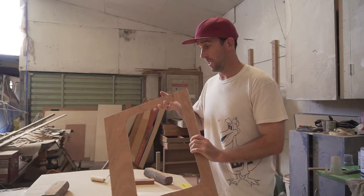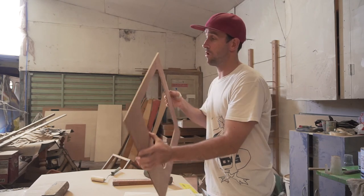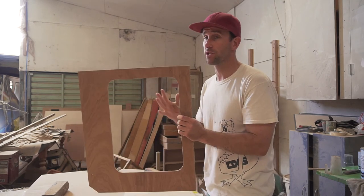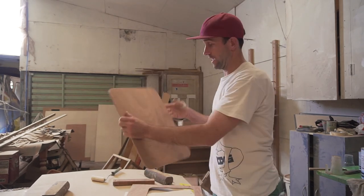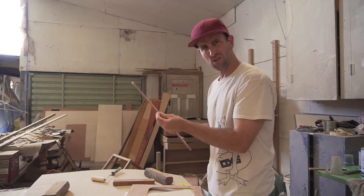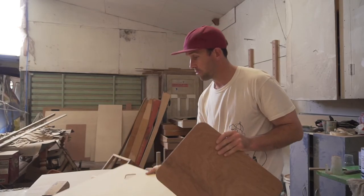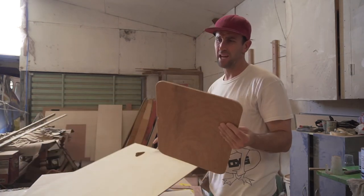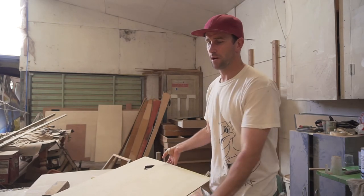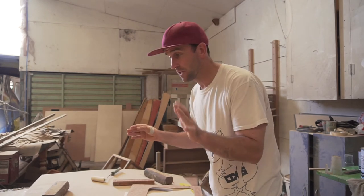This afternoon we're going hard on the cabinetry. These are basically just the faces of all the cabinets. It's pretty simple — it's 6mm marine ply. I wanted to keep it all very simple and very light. We cut the doors out of them and any hole from starting the jigsaw cut will just be covered by a latch. I'm being a bit picky, but because this is a mixed hardwood marine ply you can see a lot of colour change between sections. In the future I'll look at matching wood colours better.